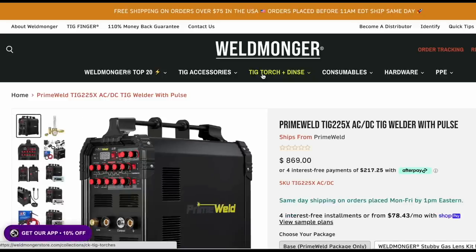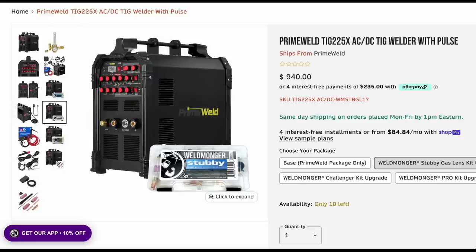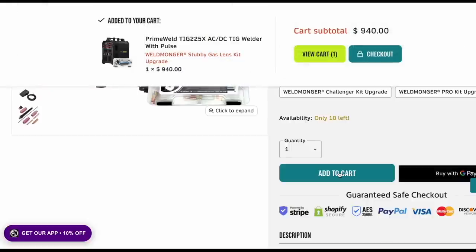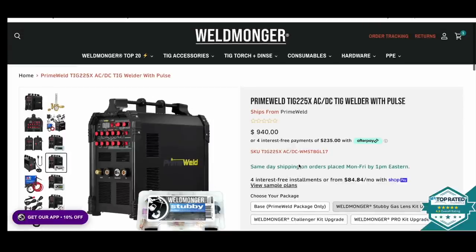One of the questions I get asked most frequently is: what's a good, affordable TIG welder where the company stands behind their product and takes good care of their customers? This machine definitely fits the bill, and that's why I added it to my store. I wouldn't exactly call it an entry-level welder — it's much more than that. This welder would have served me well in my side hustle days getting started. I bundled it with some kits because I think that's going to improve your experience, but you can also order it just as is. If I was buying this welder, I would 100% at the very minimum get the stubby gas lens kit with it — the hardware has O-rings, so it'll let you use clear cups as well as ceramic cups. I hope this video was helpful with the 2T and 4T instructions. Thanks for your support. Thanks for watching. I'll see you next time.